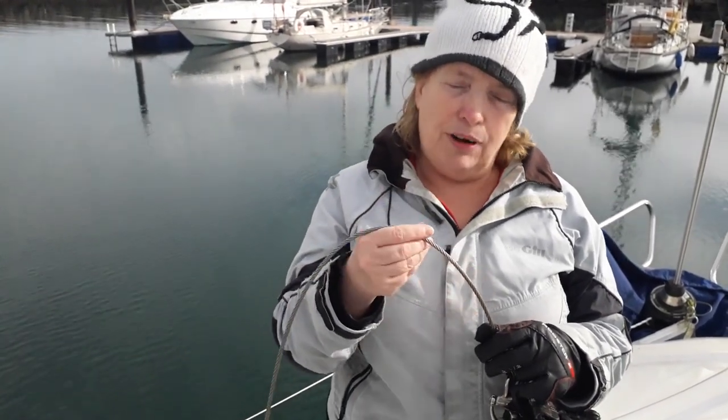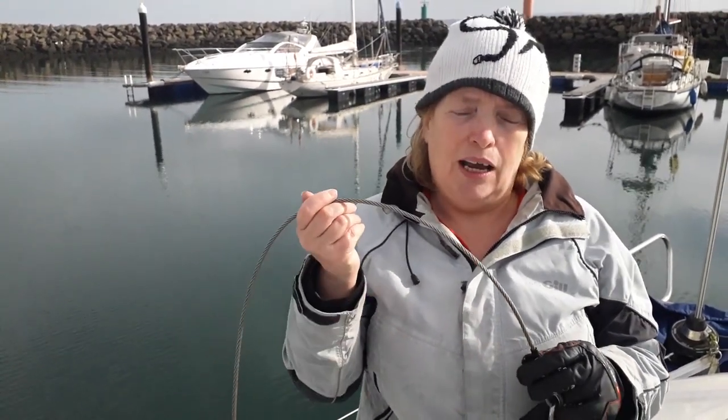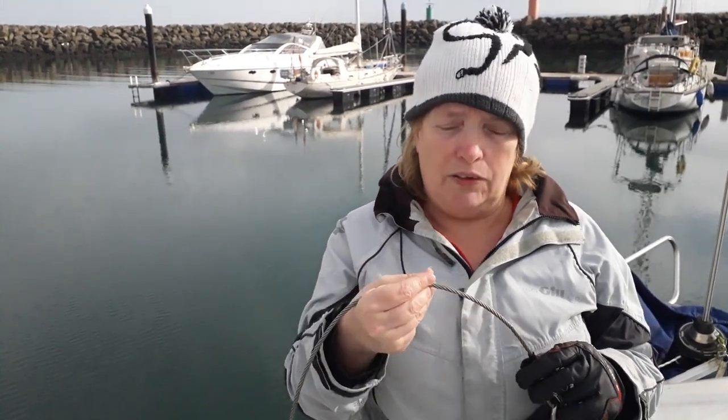While we've got the sail down, we have a wire splice on our halyard here and I'm just stroking it because what I'm looking for is any burrs and lumps. Lumps show an internal break, whereas a burr means you've got an external break there. So while we've got the sail down I've gone right over all of the line and just made sure there are no burrs.